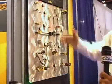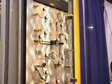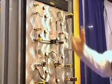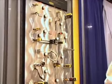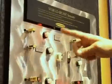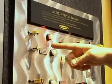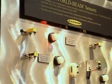We're here at the Banner Engineering booth. We have Aaron Bigger, Senior Application Engineer with Banner Engineering, who is going to talk about the WorldBeam sensor line. This line consists of three package sizes. The Q12 is our small package size for tight locations. It replaces a lot of fiber optics — you still get more power and range compared to a fiber optic. Right here is a fixed field mode, which gives you a fixed range made to sense any object within that range and yet ignore background objects. Very good performer.